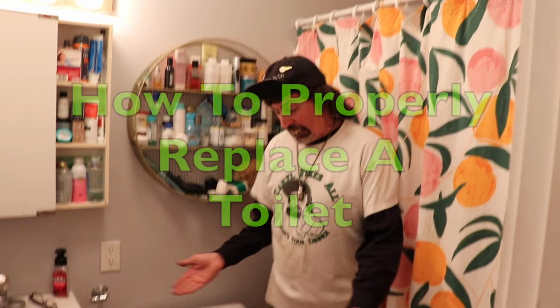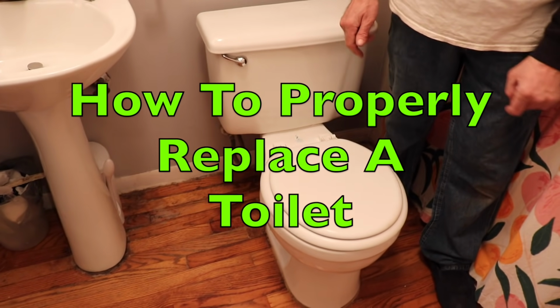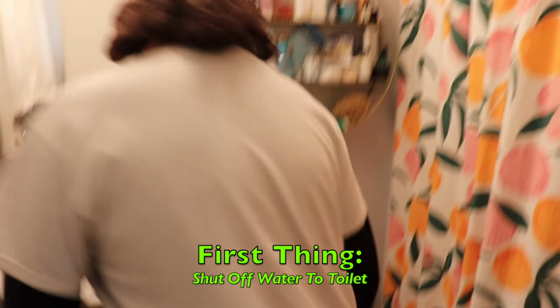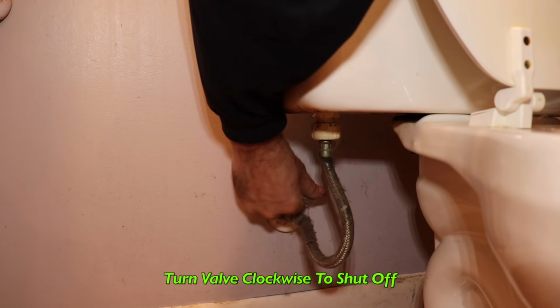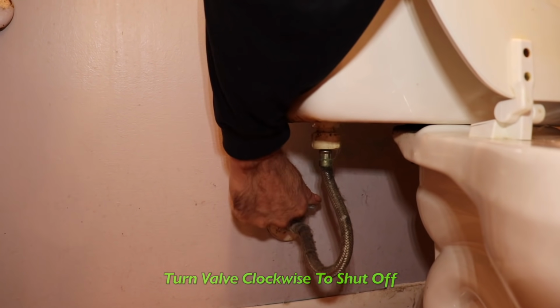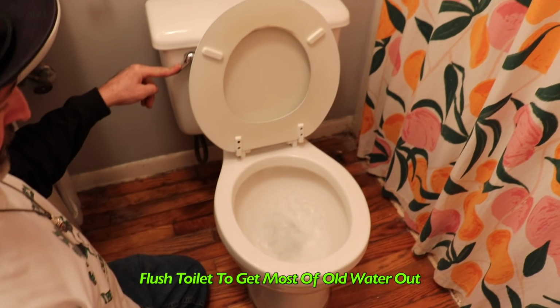Pterodactyl here. Today's how-to video is going to be on how to change your toilet. That's right. I'm going to show you how to remove and replace a toilet with a new one. So the first thing you're going to want to do is shut the water off to the toilet. There should be a valve to shut it off. You want to shut it off, then you're going to want to get the water out.